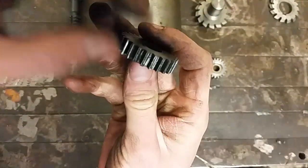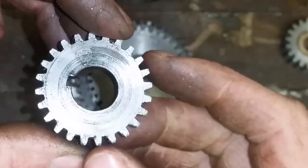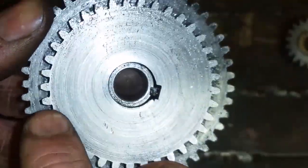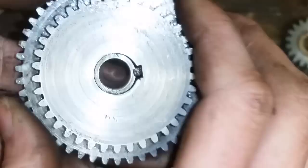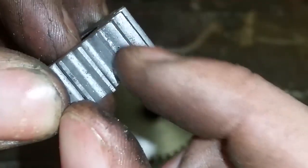The hobbed gears have edges rolled over and the tooth profile isn't so great either. The fly cutter didn't produce a better tooth profile, and it ended up being a bit wide at the root, though it does result in a cleaner cut and is a lot faster method. And then actual gear cutters are amazing — no chatter or marks.